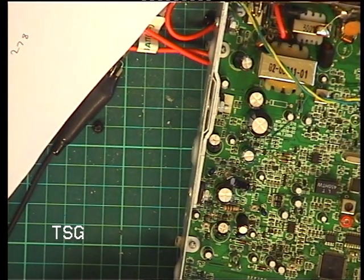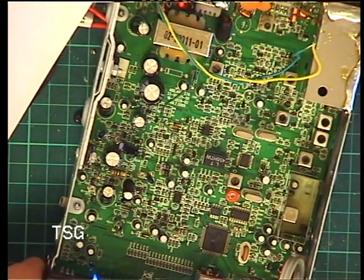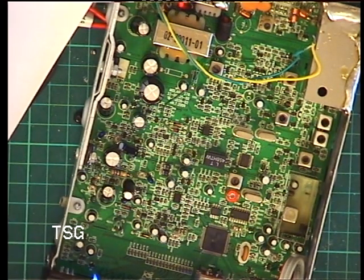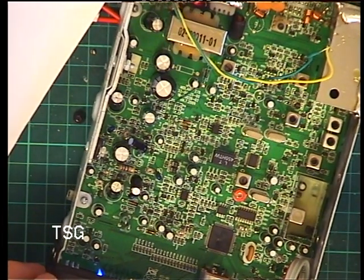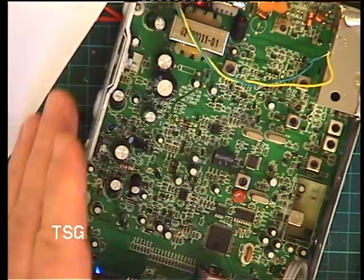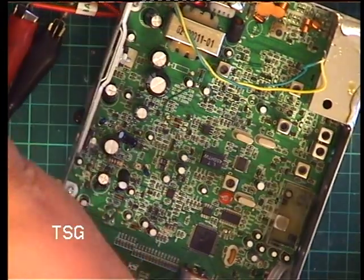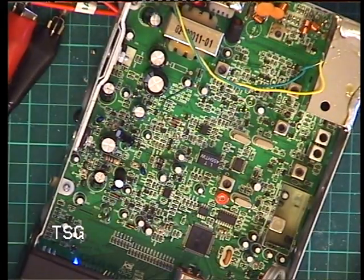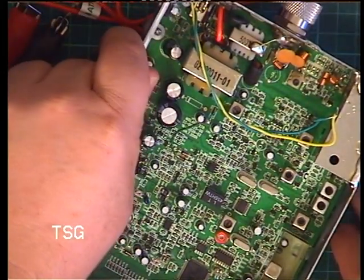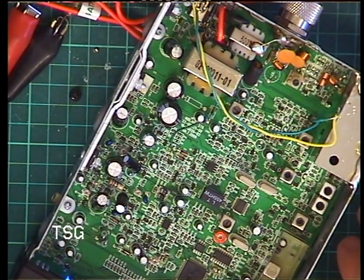So we're not touching the VCO. I'd need the service manual to set that, and of course it's a new set out of the box, and it shouldn't ever need adjustment unless they've been fiddled with. So that covers it. I don't think we've left any stone unturned on that. I was very surprised of it doing was it 8.5, 9 watts or something, but made sure that's turned down to 4. And the danger is, I mean, legality aside, if you thrash something like this, it's not going to last very long at all, is it?